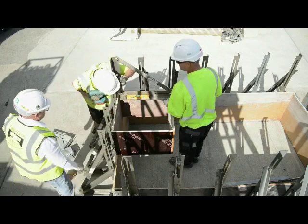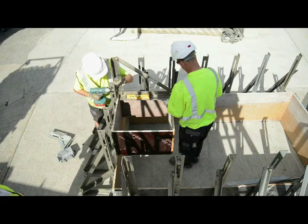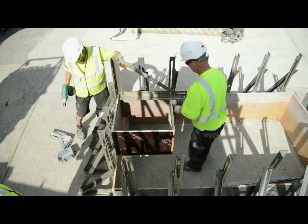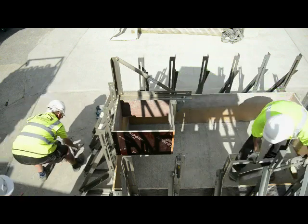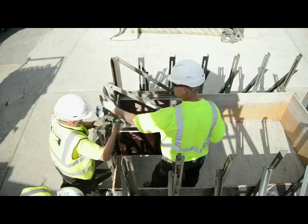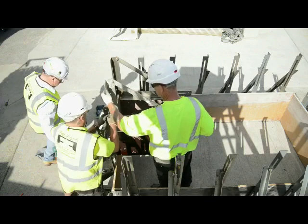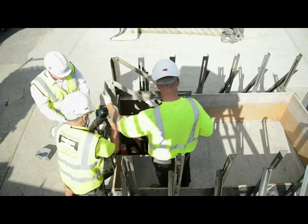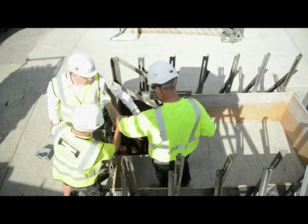So a simple bolt bolts the two brackets together. You'll notice that the bracket that we're putting over the top has also got a bracket bolted to the front of it, or will have. So you've got 3 brackets bolted together there to form the shape over the top, which would hold the plinth in place. And then between the 2 brackets over the top, we could fix a couple of 4x2 timbers and hang our bolts from those.